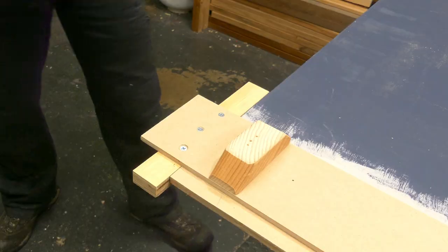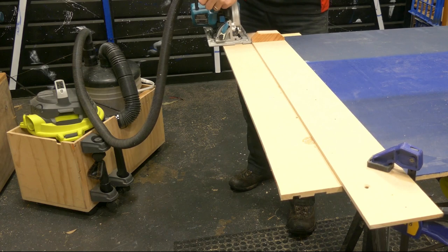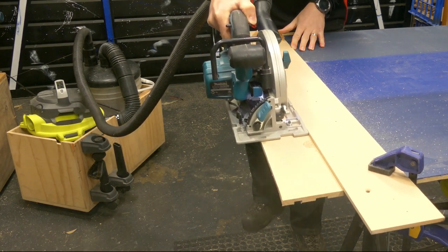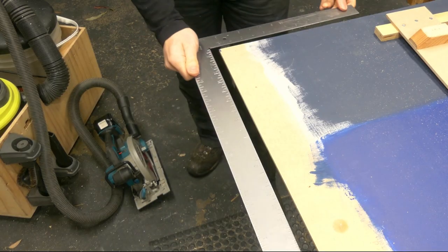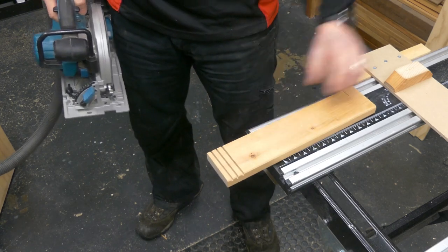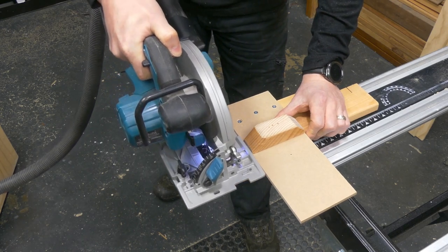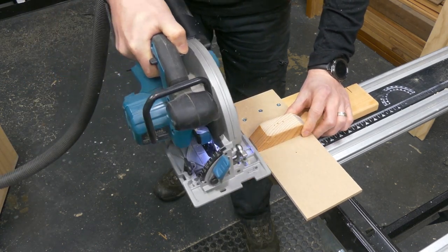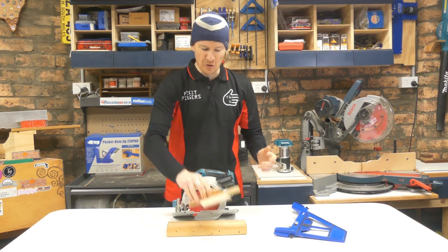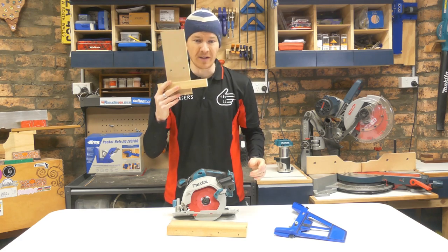Now we can line up the edge of the guide to the piece of MDF that we want to cut. Clamp down the long end to make sure that it stays put and we can run our saw with confidence that we're going to have a beautiful 90-degree cut exactly where the edge guide is telling us to go. A more common use of this might be the short version — about 30 centimeters long — where you quickly line up that edge guide to where you want a cut, and it becomes a simple accurate device. Our homemade cross cut jig is incredibly useful, so fast, so repeatable, and so simple to make — literally five minutes, you can knock one of these out.